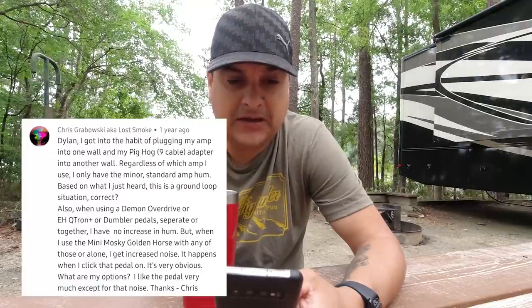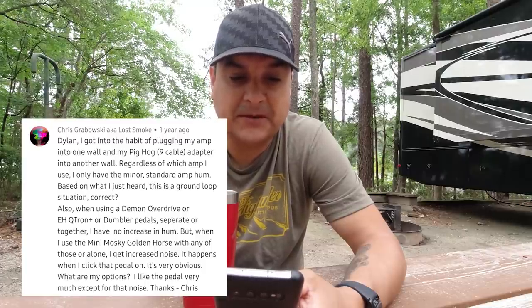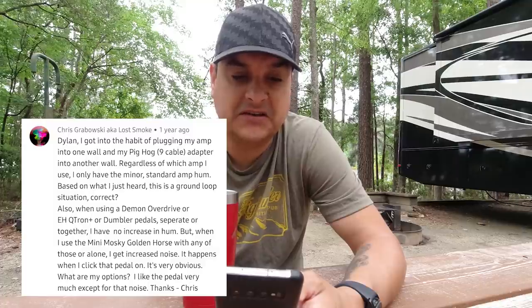Dylan, I got in the habit, this is an older question, but for some reason it popped up on my feed. I got in the habit of plugging my amp into one wall and my Pig Hog cable, 9 cable adapter into another wall. Regardless of which amp I use, I only have the minor standard amp hum. Based on what I just heard, this is a ground loop situation.